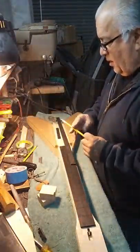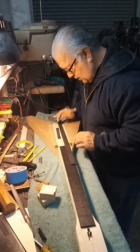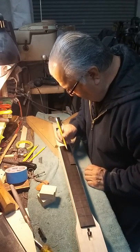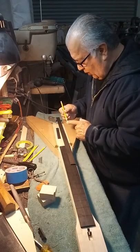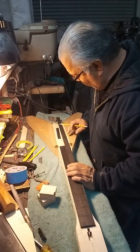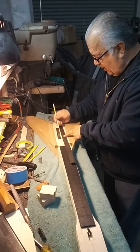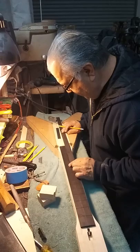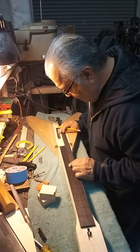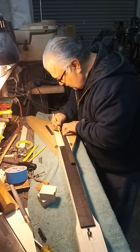Getting a straight line down the center. I have to allow for the thickness of the pencil lead, so let me get a sharper pencil. I'm allowing for the thickness of the pencil lead, and I'll roll the pencil, keeping the point from getting blunt — I rotate the pencil as I make a line. See how this straight edge flexes? This is good because it'll flatten the straight edge to the body and I can draw my center line.